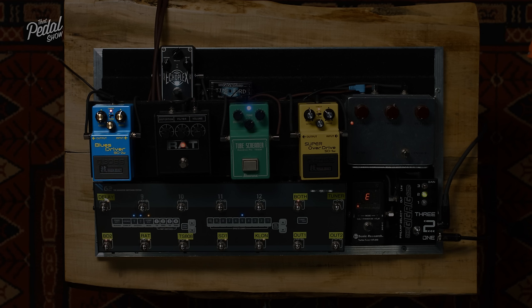what we're going to do now is dial the gain all the way in so we hear what happens with these. You play, I'll just turn it up. What we're doing is leaving the amplification bit the same, and we're adding in those clipping diodes. All different sorts of diodes will give you different sorts of sound. We'll get onto that. Here we go. We'll hear the clipping diodes now that come directly after the gain stage in this pedal, which gives us what we call hard clipping.